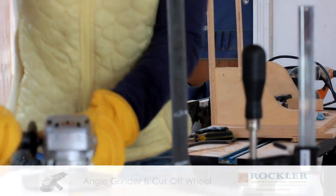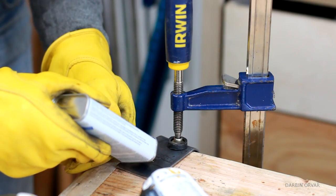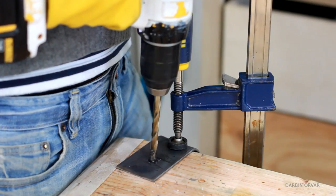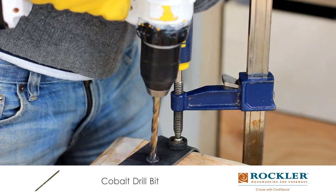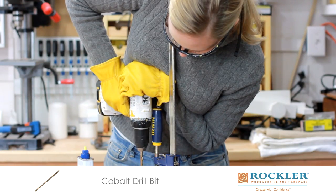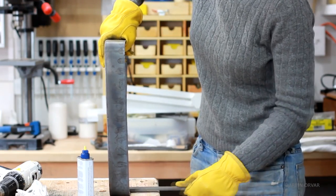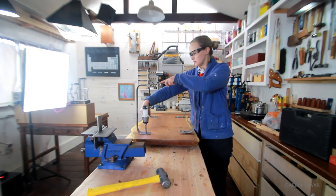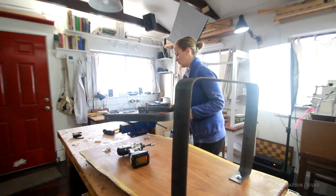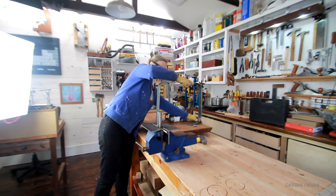Then I used an angle grinder to cut the excess off. I clamped the steel down and drilled a hole on each end, using a liberal amount of cutting oil to lubricate. I used a five sixteenth inch cobalt bit with my hand drill, since at this point I couldn't put the metal in the drill press with all the bends. Then I drilled holes on the underside of the slab and attached the steel with a lag bolt, and continued the process all around. Once I had both legs attached, it was easier to see where I needed to adjust the bends a little to get the base even and straight, so I took them off and made some fine adjustments.